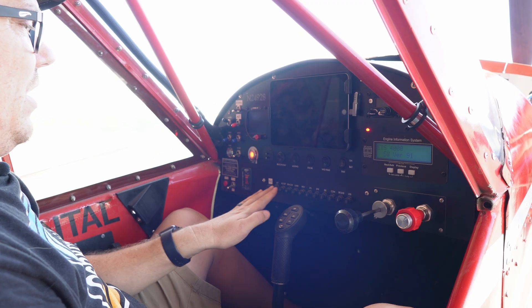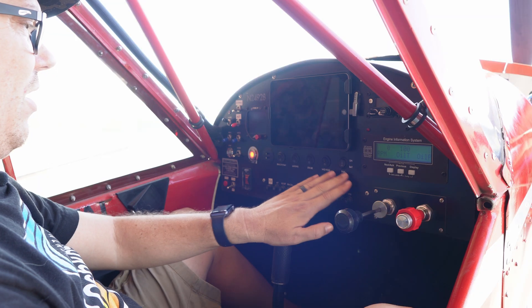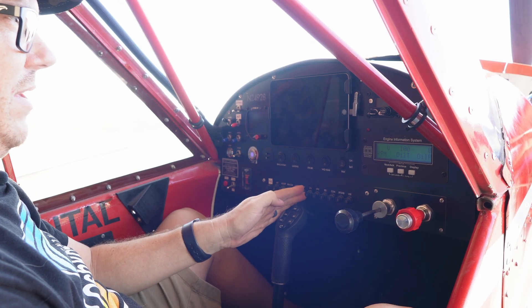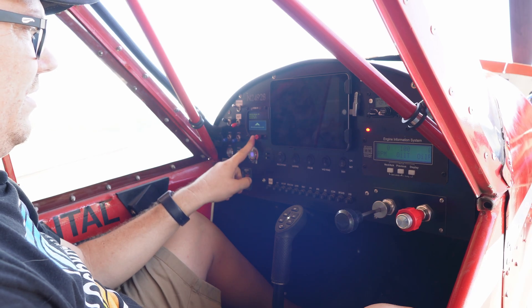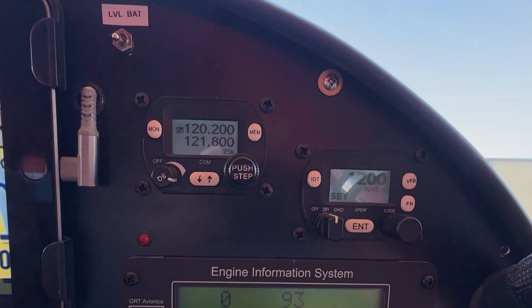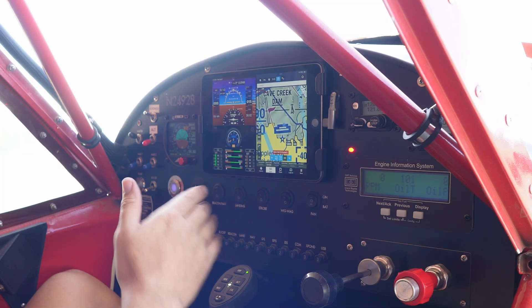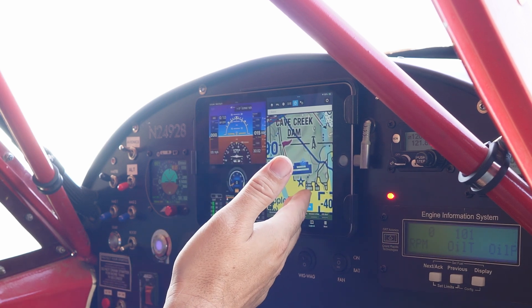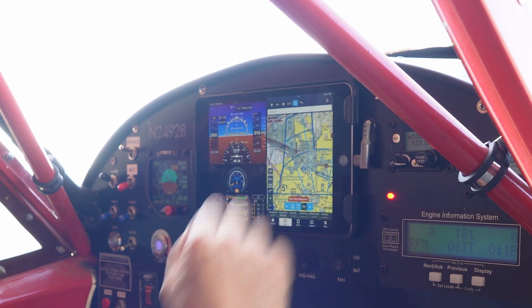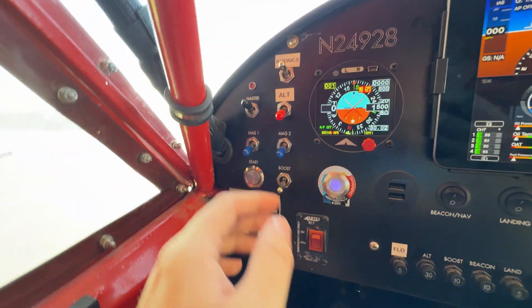Let's get all of this started up. We start with the master switch, which will turn on everything up to right here — my beacon, landing light, strobe, wigwag — all of those functions work up to right here on my fuse panel. Next we can go with avionics on, and you can see that turned on our little backup right here as well as our radio and transponder. I have this set up the way I actually like and will be flying with. We've already acquired information from the iLevel autopilot and we're getting GPS information showing us where we are inside of ForeFlight, and this works beautifully.